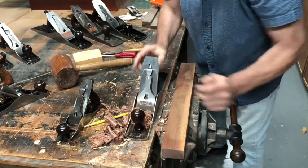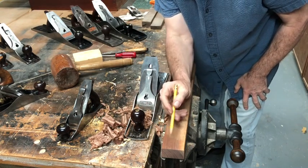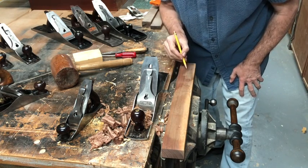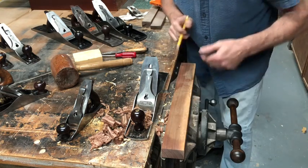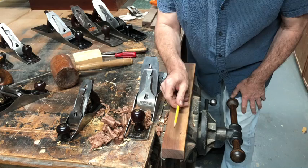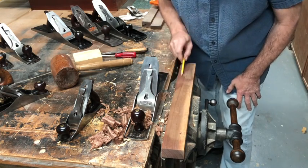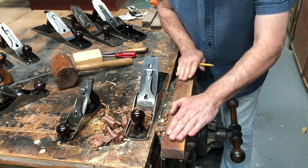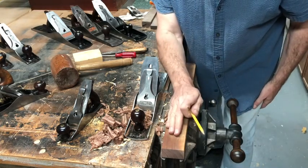You can always come back, but examine different parts of the wood as you go. Here's a hole, so I'll square this up and then go to the other side and find the best side I want to use. I'll remove more of the side I don't want to use — that way I get the best piece for the job. The plane is hitting here and here, but not in this area — those areas have to come down before it will cut there. To flatten a board, remove all of the high spots rather than trying to dig out the low.